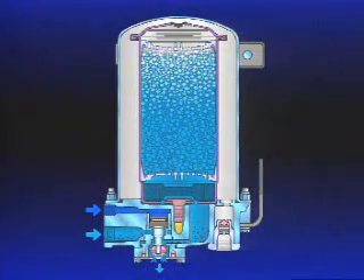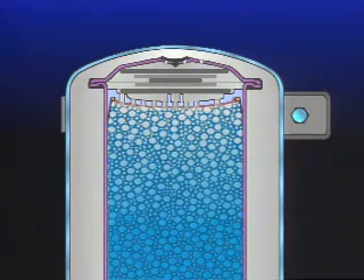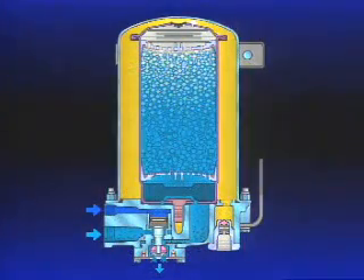At the same time, air in the purge volume and air passing through the desiccant cartridge reverse direction as the purge valve is opened. Air from the purge volume passes through the orifice adjacent to the check valve and expands to near zero PSI, becoming super dry before flowing into the desiccant cartridge. This super dry air regenerates the desiccant material by stripping away accumulated water vapor.